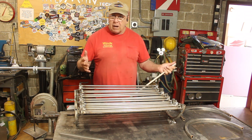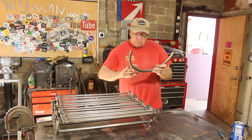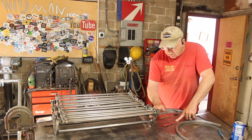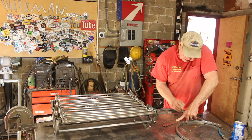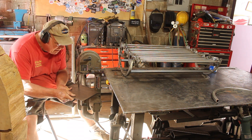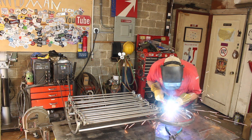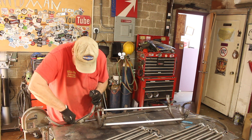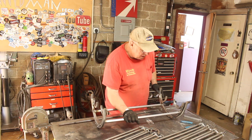While I'm doing prep, I think another thing I want to do is make some guide plates for the side. I don't think they need to be that big — just big enough to keep this loop from sliding off that one, so some semi-circles should be fine. The fit was really tight on those side plates so I had to bend it out, and once I did that it provided a good amount of clearance and started working. Oh yeah, that's working good.